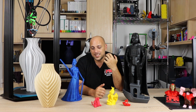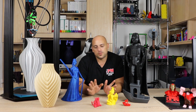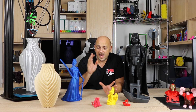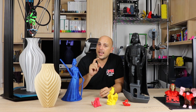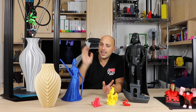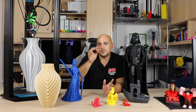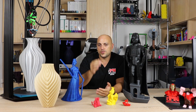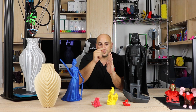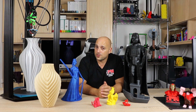The printer is actually quite solid and turned out to be very reliable. It's one of those printers where I have no problem letting it handle a 20-plus hour print, because I honestly know it's going to finish it. The only time I almost had a failed print was when loading filament — this printer has an automatic load and unload filament function, so it moves downward and pulls the filament with it, then extrudes a certain length and goes back up. What happened is the filament on top of the spool fell off and was about to snag on the spool holder. Thankfully I caught that in time, so if you're getting this printer that's something to watch out for.